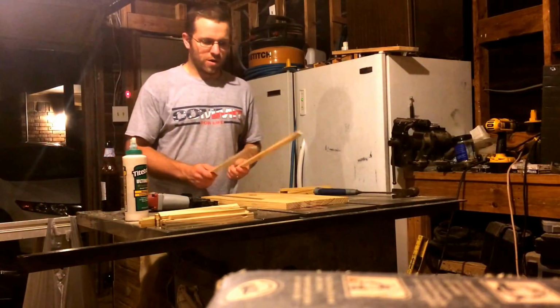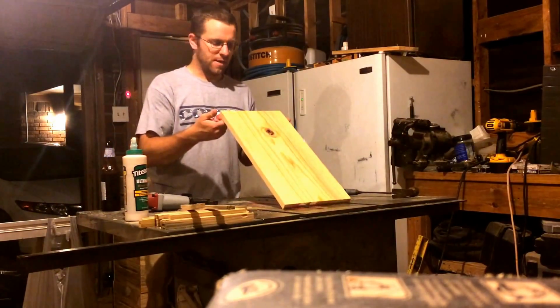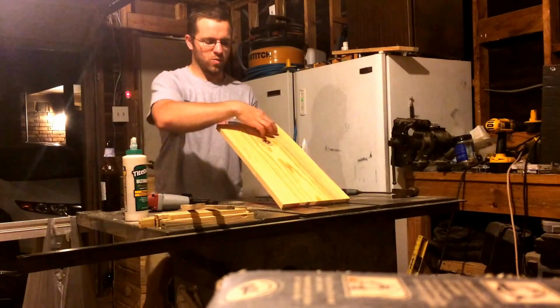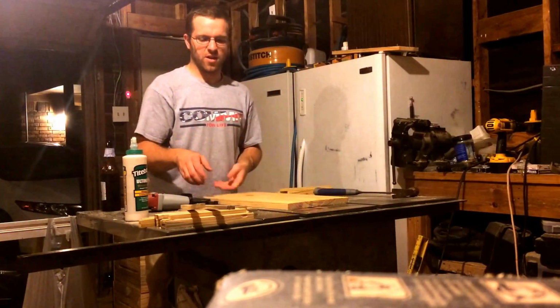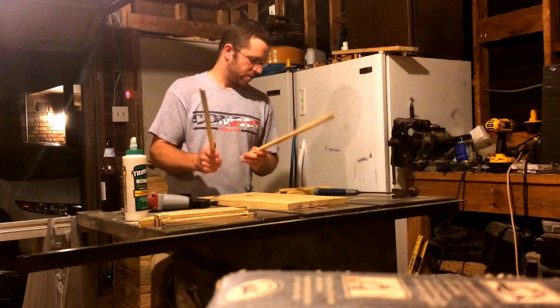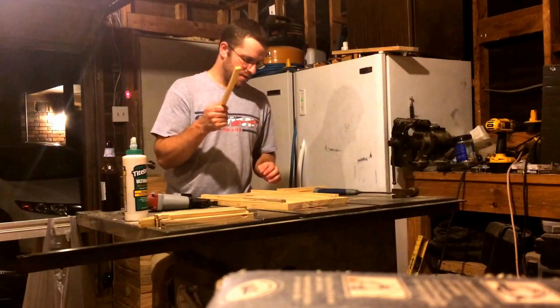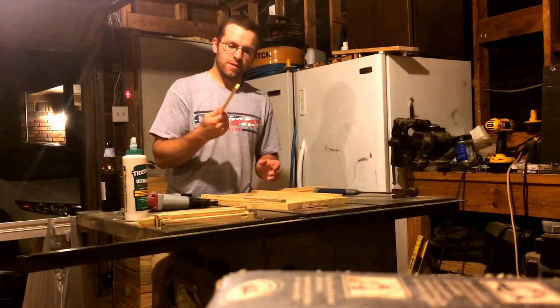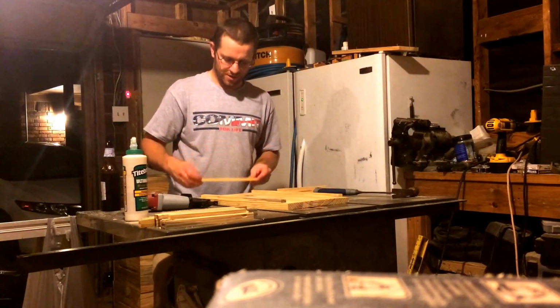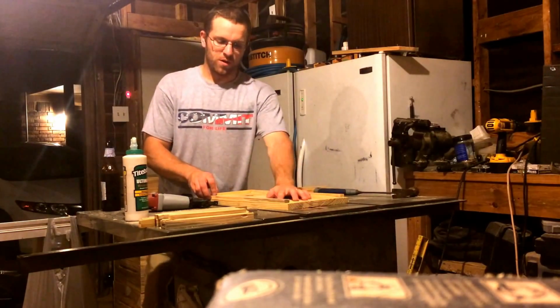Now for the bottom board, and y'all should like this even better. This is even simpler. Same size, 9 5/8 wide, 19 7/8 long, two 18 3/8 by 3/4 by 3/8 shims, and one 9 5/8 by 3/4 by 3/8 shim. And really, you can just leave the front open the way I build them.